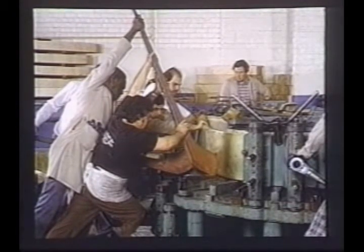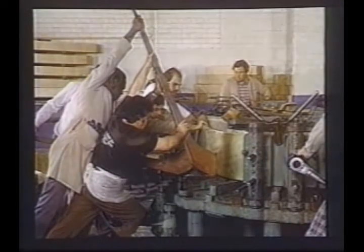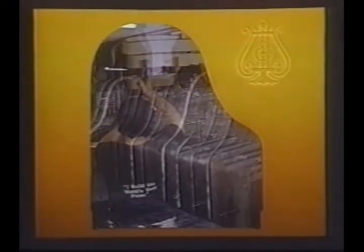The presses, by the way, are lined with a brass sheet. A second brass sheet covers the outside of the package. The brass sheets not only protect the rare wood, but serve as electrodes for the heat-setting process. After the final pressure, the urea resin glue is set with high-frequency heat. This makes a solid, highly moisture-resistant rim. What results is a homogeneous foundation of unified inner and outer rim capable of standing the tremendous tensions of stringing.